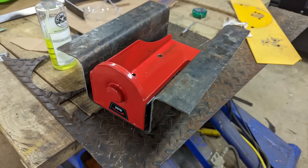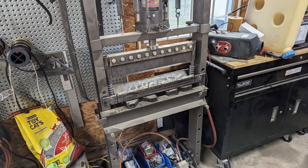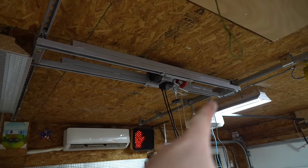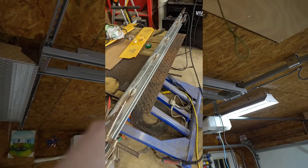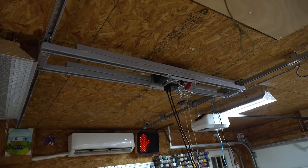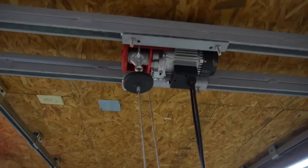To make the carrier that the hoist sits in, I just had some scrap steel laying around the shop — a little thicker than one-eighth inch diamond check plate. I cut it up using the Eastwood metal cutting saw and took it over to my 20-ton Harbor Freight shop press, which has a Swag Off-Road finger press installed, making it really easy to bend the steel the way I needed. The total span is six feet, and there was a little bit of bounce when hanging on just one beam, so I welded another one upside down — only five feet long. This eliminated the flex and adding the second beam gives that much more strength. We have two directions of motion: back and forth across the carrier, and dragging the whole thing across the shop.